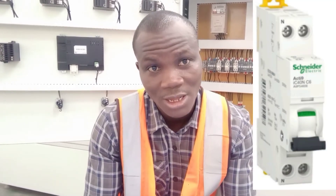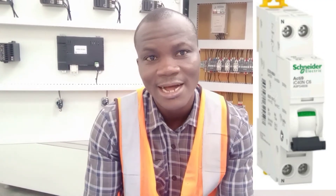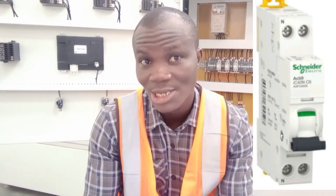So it's quite simple. Let's talk about this type also — this one doesn't come with an earth connection, so it is live and neutral input, live and neutral output. In the case of the RCBO, you don't need any additional MCB, as in the case of the RCCB. You just make sure that the in and out live and neutral connections are connected appropriately at the right terminals.